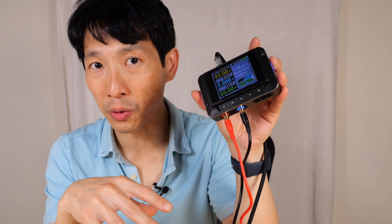A very handy device to have instead of those typical bulky power supplies — you know the type that are in labs. They're like this big and kind of heavy. If you just need a voltage and up to 150 watts, and if you're not too picky about the output ripple, which can go all the way up to like 150 millivolts or so, if your equipment is not that sensitive, then you can definitely use this. For example, like electronic toys, you can use it to power a game controller temporarily for fixing it.